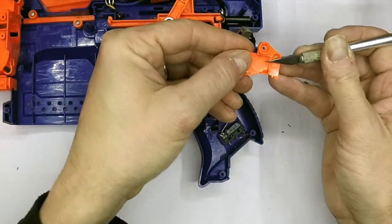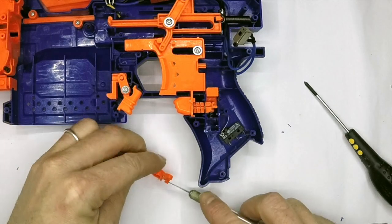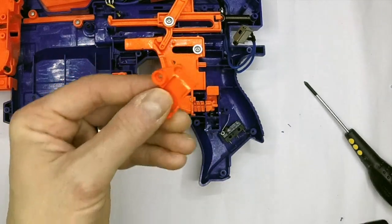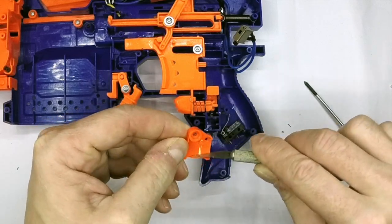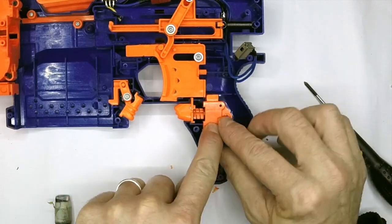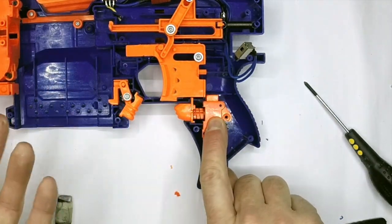I made an initial cut here on that ridge piece with a pair of plastic shears, now I'm just going to carve that out. This is the same process you can use for any ribs - you don't need a Dremel to remove ribbing from plastic parts, you just need a decent knife. So that cover is now set up so that it's going to fit really nicely, and that's actually holding the micro switch quite well on its own. You can see that my trigger works.